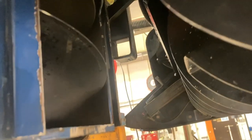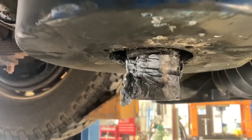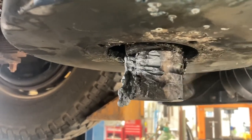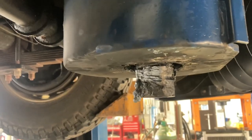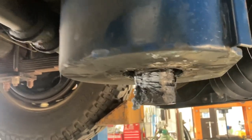But this time, for whatever reason, this thing is constantly getting pelted with snow from the augers and it's going to melt down into the race. If you've got a little bit of ammonia or salt possibly from the softener, you can get some really corrosive types of water in there. So that's something that should have taken me 20 minutes and it took a lot longer, but I'm glad I'm doing it here where I have the hoist.